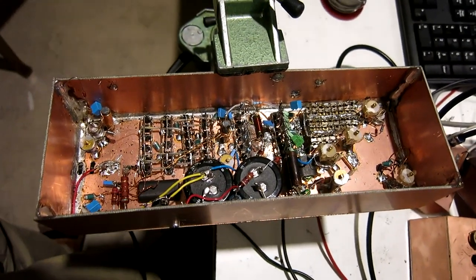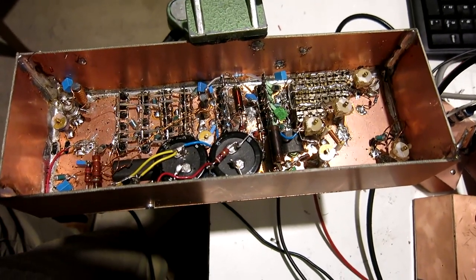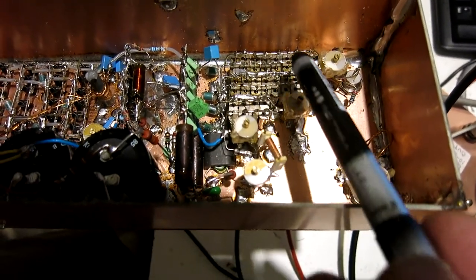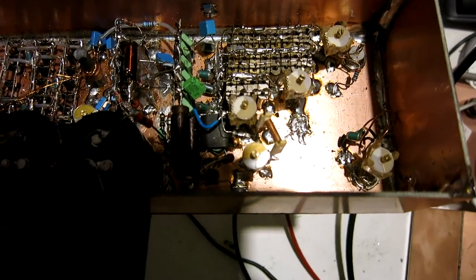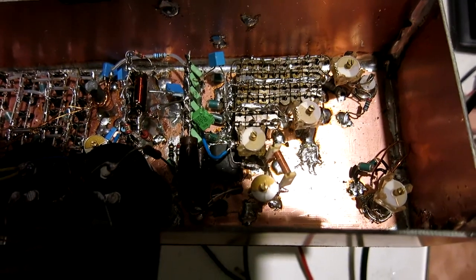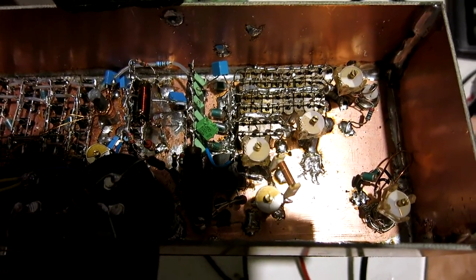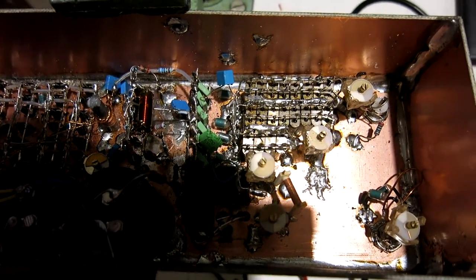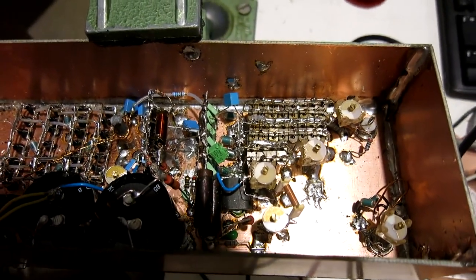Here I have a selective amplifier that can also be used as an oscillator. It has a filter with 20 parallel crystals, selected from 200 crystals from manufacturers AbraCon and NDK, which have turned out to be the best ones — about 1 in 10 of these crystals is useful. You can see more about that in a previous video in this NERDs series.